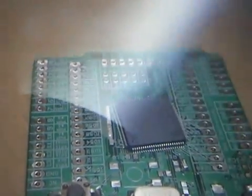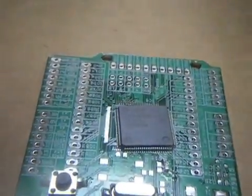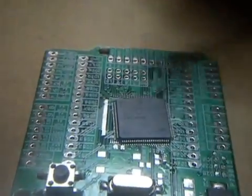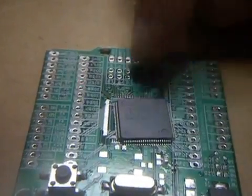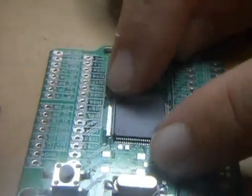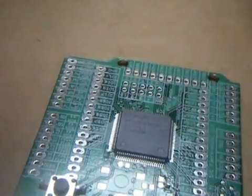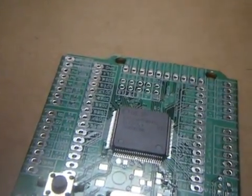I'm not going to use the soldering iron to push on the pins because there's solder on the pins and I don't want to get it on the pads. You need to use your fingers or anything to move the chip — don't use the soldering iron, because you don't want to get solder on these little pins or legs. Get it roughly in place. You're not going to get it perfect, but that's how it should be — you're good to go. Now grab the thick solder, not the thin one, and the tip.